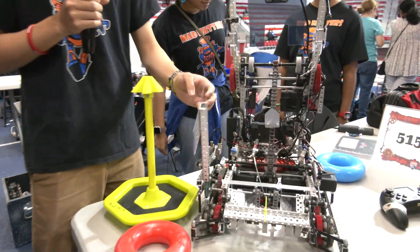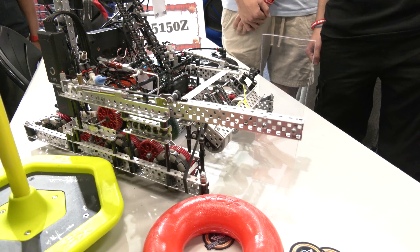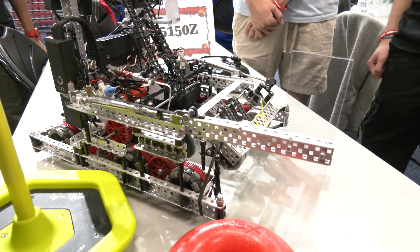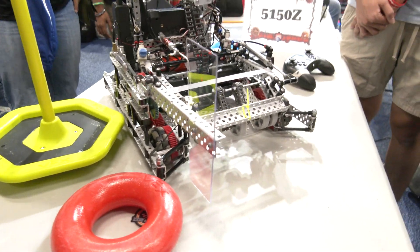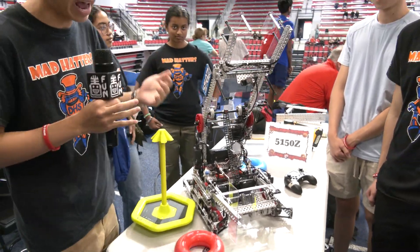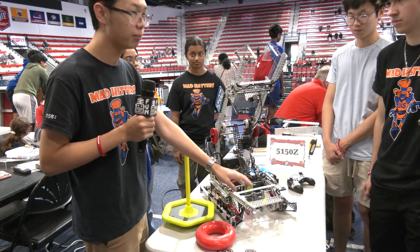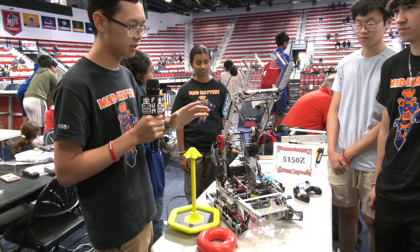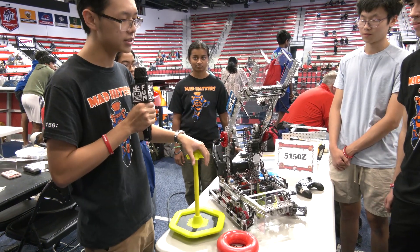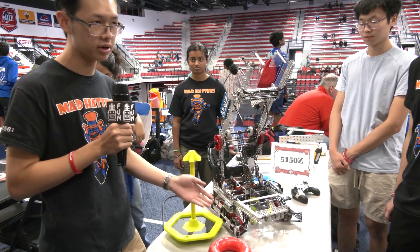The sweeper mechanism was added after watching signature events, where we noticed robots had a really tough time clearing the four-ring corners. You need that positive corner to have a chance in a match, and spending 20–30 seconds clearing rings so you can score a goal there isn't efficient — especially if you also need to play offense and score rings on your own goal. So we added the sweeper to clear it out quickly. It's not perfect yet, but it clears the top three rings, and the final ring sits just fine — the goal can rest on it and still overhang into the corner, still touching the field, so it technically counts. On the next robot we'd like to extend it further to clear all the rings.